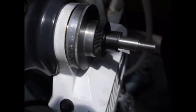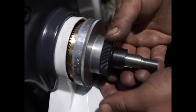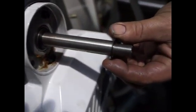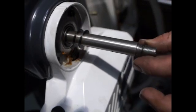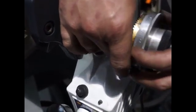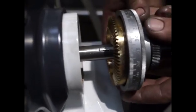We're just going to take this apart now and show you where you need to do a bit of shimming, which is where the vast majority of the work is when putting one on. You can see we're just taking a couple of the shims off now because we weren't happy with the position. These are all in the pack, by the way. We take one of those out and put it back together to see how the land lies. When you put it back together, it's easier if you make sure that the little woodruff keys are upwards so they don't fall out.